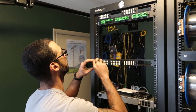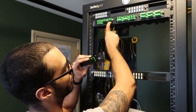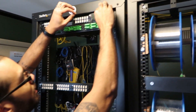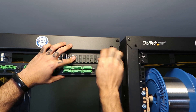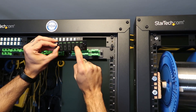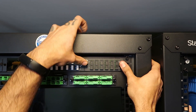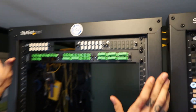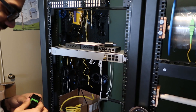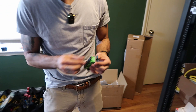Since we're done with the cable management side, we're actually going to be adding a FDX1 panel — we've got to replace the current panel that's in here. I'm going to be placing this one here. First, I want to make sure — counting 12 ports, that's the way they've broken down. I probably should have taken the back off first — it gets a little more difficult to take this stuff off once you get to the actual installment piece. So right now we have eight fibers, and we're going to open up eight of the ports, one through eight.